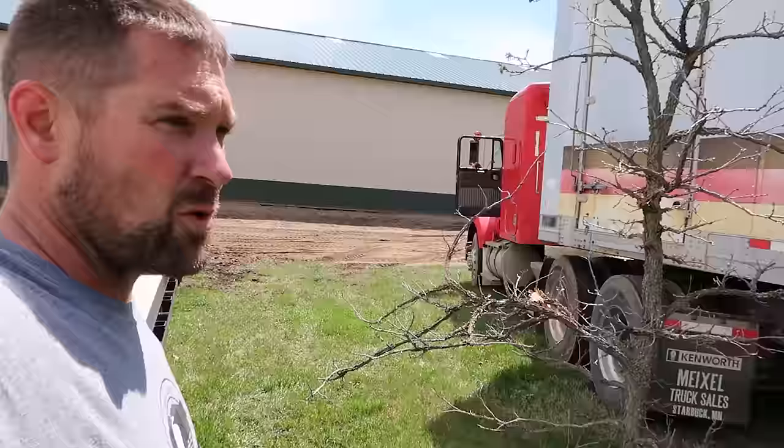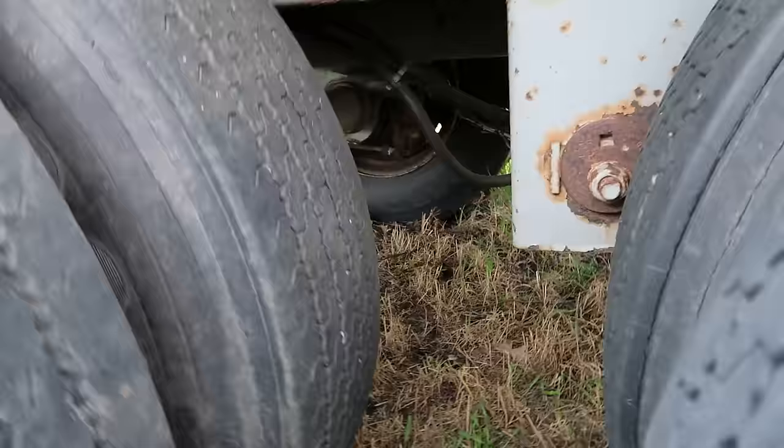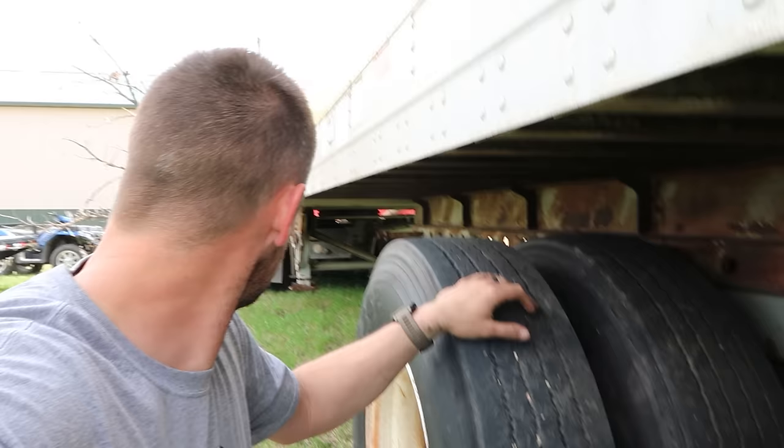Well, you didn't miss anything. I pushed him out and then the next try he hit it perfect and it's locked, but there's a valve underneath here, right up in there, that sticks every year. And we gotta work that loose before this thing wants to come out of here. So it's a good sized air leak, which means it won't build air pressure and blow the bags up and take the brakes off. Down to 90 right away.